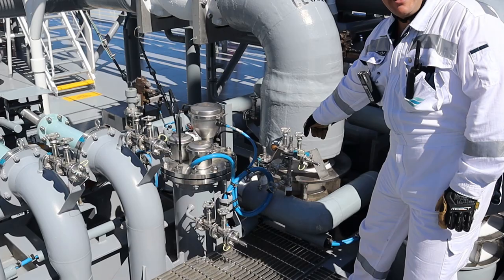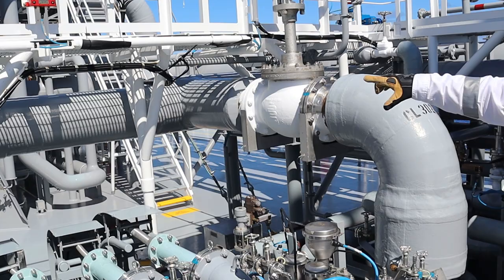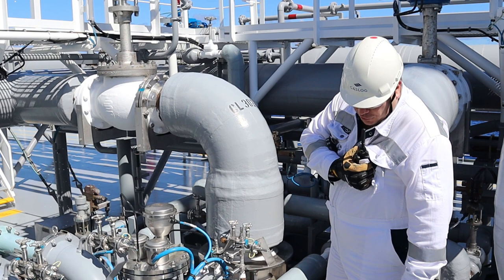From inside here, this is the spray pump — it's coming out, going inside, and going up to the T-valve. From that point it goes inside the liquid line which is connected to cargo tank number three. It's not going to the main liquid line, which is out of the branch valve back there. So it's good to go — I'm going to call the chief officer.